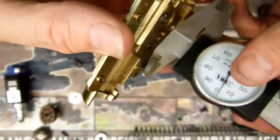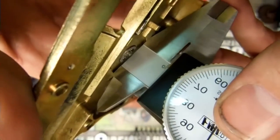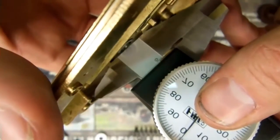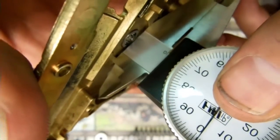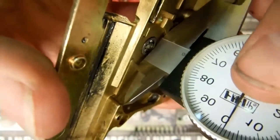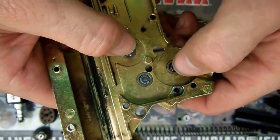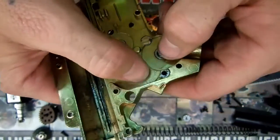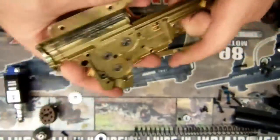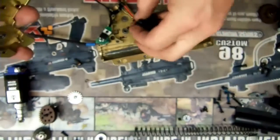If you take a flat piece and you go across, you can see that there's a significant gap in between the bearing and the flat edge of that piece. So these are still recessed. The bevel and sector gears are still recessed further than the spur gear is. That means you can't put any other gear type in. Take the SHS gear. Can't put it in there.